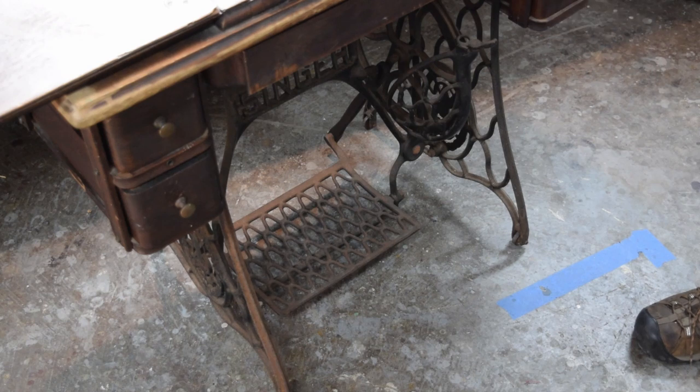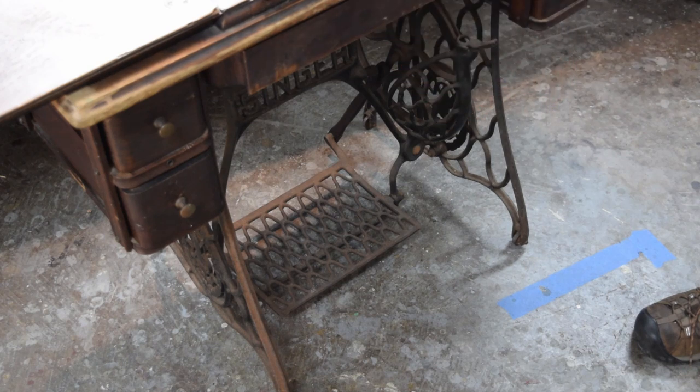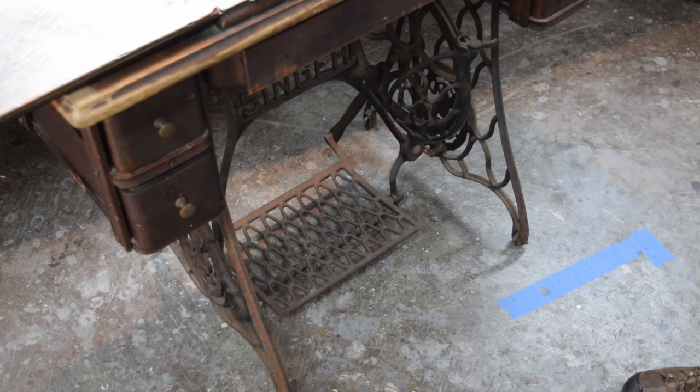So what we'll do is we will completely disassemble the machine. We'll work on the base first because I'm going to have to order new veneer. I spoke with the owner and we've decided to replace all the veneer on this machine rather than try to patch in spots. That way everything has a uniform look when it's done. So let me get some tools.